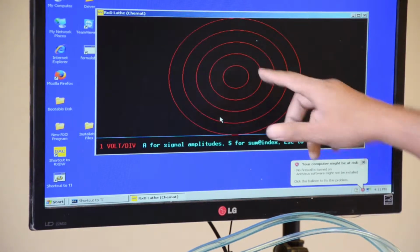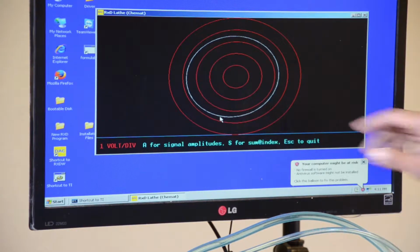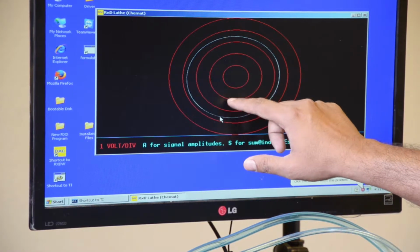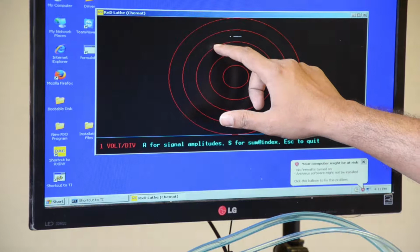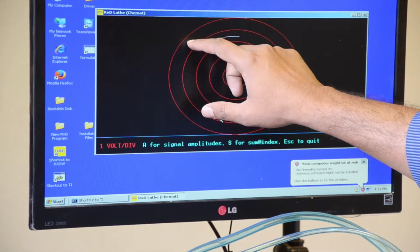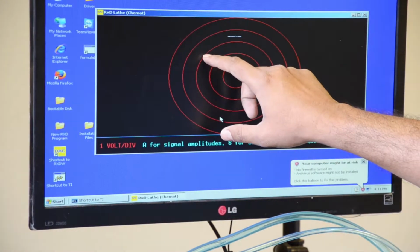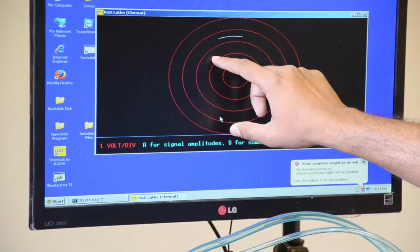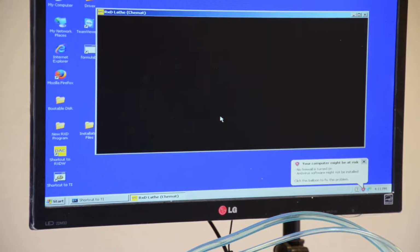This is my circular signal here, and if I spin my spindle, this is pretty good, so I like this signal. This is 1 volt, 2 volt, 3 volt, 4 and 5. The signal has to be above 3 volt. It can be 4, 3.5, 4.5. It cannot go beyond 5, and cannot be less than 3. If it's less than 3, your machine will not start. So that's what I'm checking, if my signals are okay. This is for the C axis.